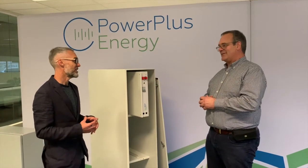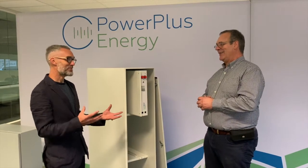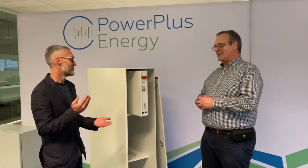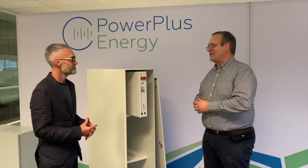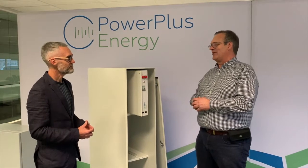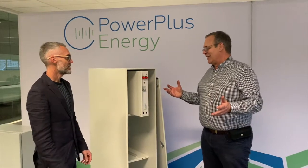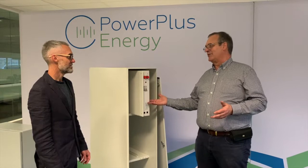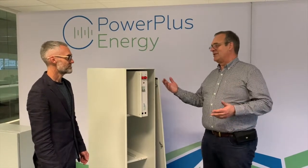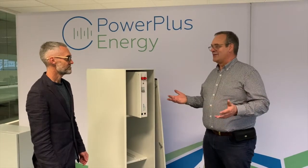You can use the Ecocell off-grid — it's a great replacement for lead-acid. A lithium battery is a third the weight of a lead-acid system and typically at least a quarter of the footprint. The batteries are 20 to 30% more efficient, so in poor weather you get more power stored in the lithium battery. If you need to run off a generator, you can charge at C2 instead of C10, so you have less run hours and less fuel consumption.